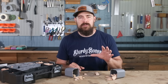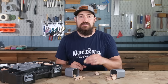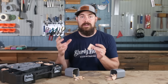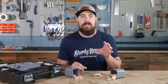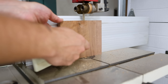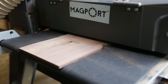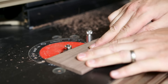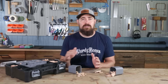Now we just need to add the joinery. But first, let's talk for a second about tenons. These are a couple of different ones that you can buy on Amazon and places like that — some 5mm thick ones and 10mm thick ones that I buy, which are the Taytools brand. So you don't actually have to buy the Festool brand ones if you're going to use this jig and you just need dominoes. However, if you're using a quarter inch bit like I'm using with my router, then you can get 6mm tenons as well, which will fit pretty snugly, just allowing for a tiny bit of glue. But you can also easily make your own. This is where you can get a bit wild and do things like make tenons that are super wide. I'm just making a really big sheet of this and then I will cut them to the dimensions that I want and put roundovers on the sides. The important thing here is to make sure you're running the grain along the length of the tenons so that you have long grain going into the mortise, which ensures that your tenons provide plenty of strength and don't break under tension.